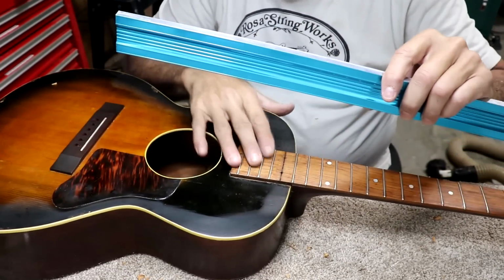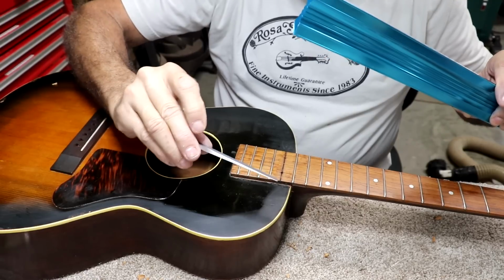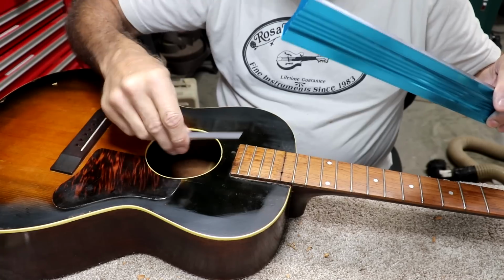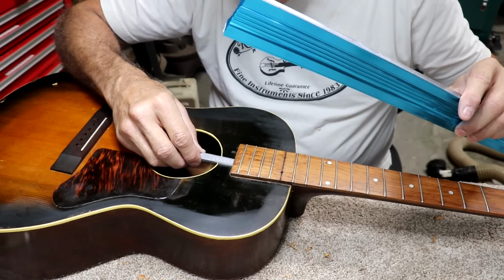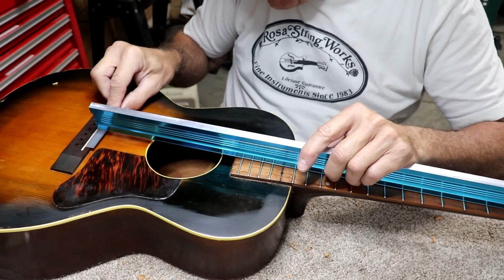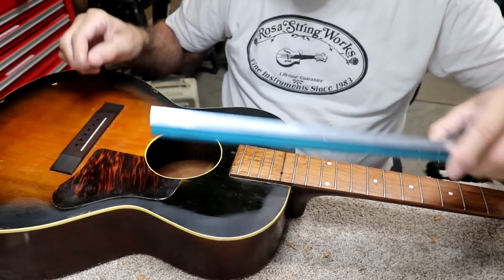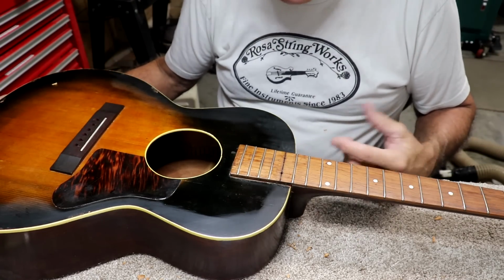Well, the very next iteration really dropped it down in there a lot. So we're really close now. So I'm taking my thickness gauge, my taper gauge. This is an In-Size taper gauge, 4630-1E. I think I mentioned that earlier in the video, but in case those are in separate parts, now you know. If I poke it in here now, I'm getting about 90 thousandths where it starts to touch. And if I do it here, I get about 150 thousandths. It's really close. So that would be about 60 thousandths difference, which is approximately a 16th of an inch. And that's just where I want to be.